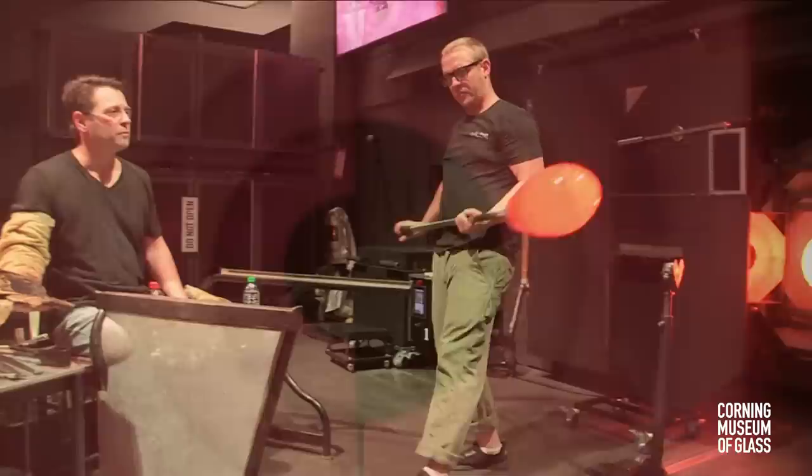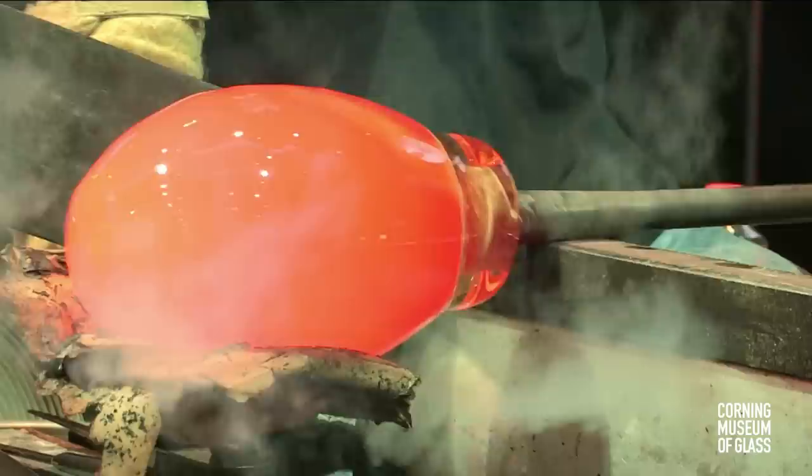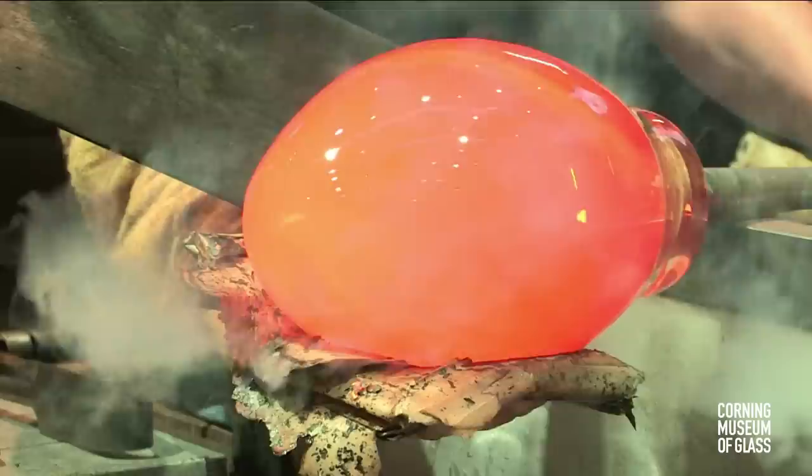The setup here for our bigger stuff, you can see this is our jumbo reheating furnace that we've been running the last couple days. It's much more comfortable to work larger scale out of. And we have these invested rails, which are really nice. A lot of people ask us about the yoke, is what we call this, the rollers that move back and forth. They say, why do you keep pushing that in and out? That just helps give us more leverage when we set the pipe on that and push it forward, and it moves the fulcrum point, right? So it just gives us a lot more control.